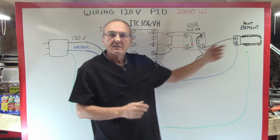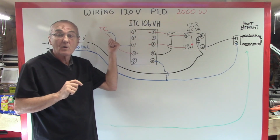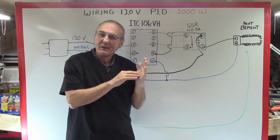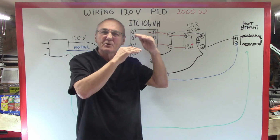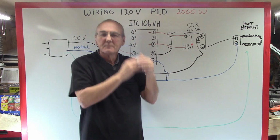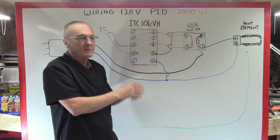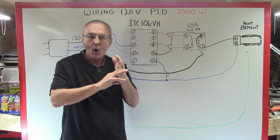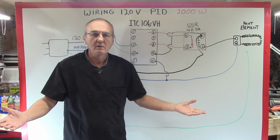And it'll do that. Then it notices when it starts to drop, and it knows how much it'll turn on and off, on and off, on and off. So it starts to work similar to a pulse width modulator, because if you can time the amount of energy going in and out on a predetermined time, you're actually reducing the overall voltage. Oh, I'm getting way too much into the theory. But for the sake of argument, if you set this at 173 degrees, 185 degrees, 190 degrees, your heating element in your system will achieve 190 degrees and then maintain that on its own without you having any input into it whatsoever. That is 120 volts, start to finish.